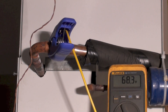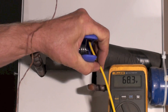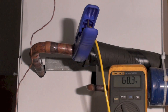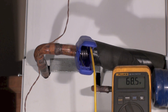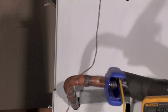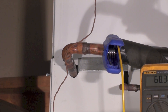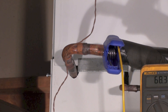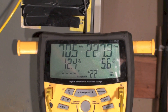You need a good clean spot for this — put it up on a braze or something like that and it's not going to give you accurate numbers. Get it down where you can get a good solid reading. With the probe on a clean piece of pipe, you may want to sand the pipe off. This should be right next to the coil. You can do it at the suction line at the outdoor unit, but it's not always as accurate — there is some temperature rise over the line sets, so keep that in mind.